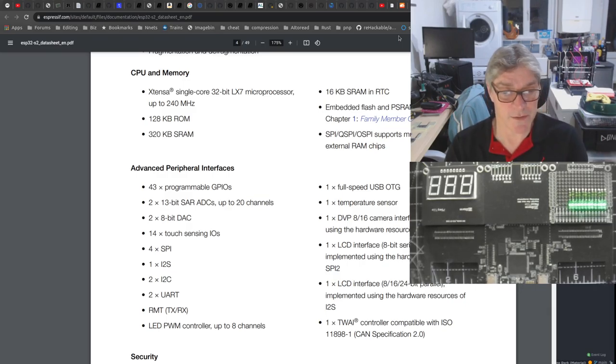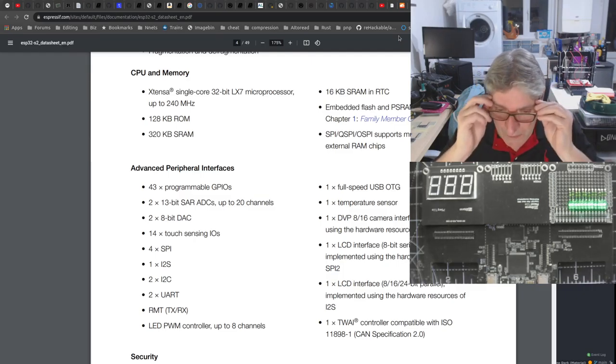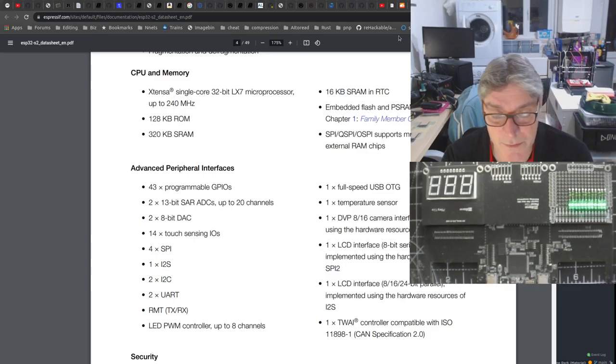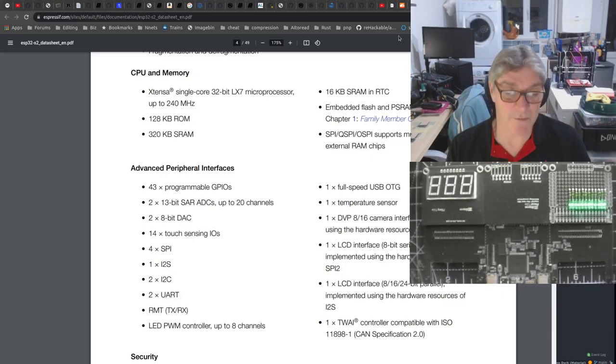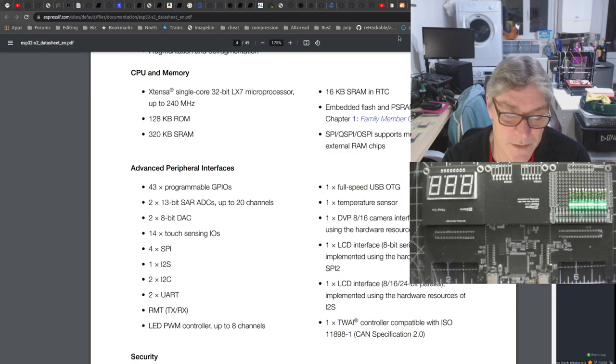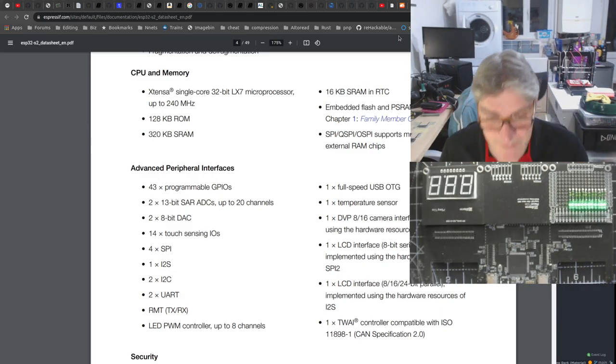I mean, you saw the kind of stuff that you can do with that when I worked on the Alloy prototype. You could just drag an FPGA image on there, and the Python could recognize the name of that and say, oh, this is an FPGA image. It could then send it to the STM32, which programs the FPGA, which is kind of nice. Plus, doing your Python on there is easy, because you just have your Python file on that storage. So there are some user-friendly elements to it which are interesting.